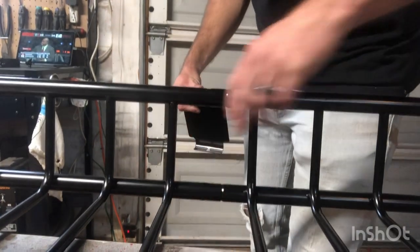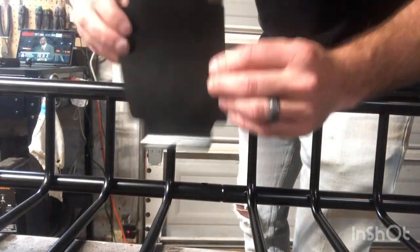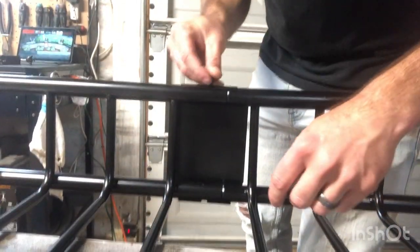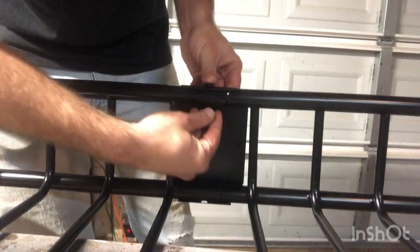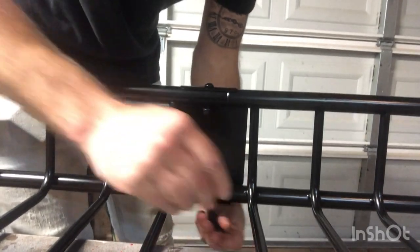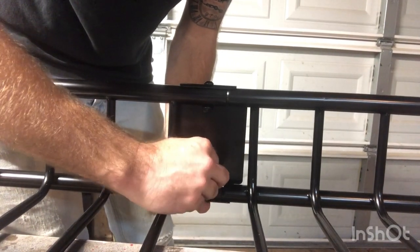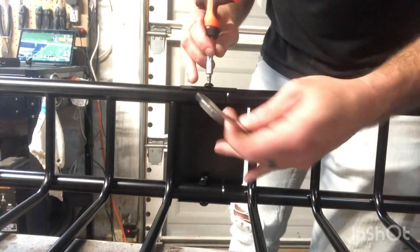Bring you guys in a little closer so you can see me put one of these together. This is where it goes together. The ends meet, has a hole in each, the top and the bottom. It's your mounting bracket right here. It slips over, just clips over it. Bolt in the top and the bottom. Washer and a nut. Number 5 Allen head, half inch wrench.